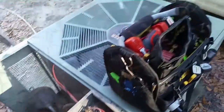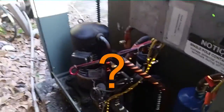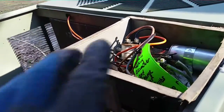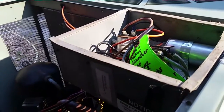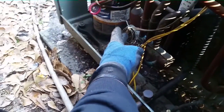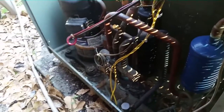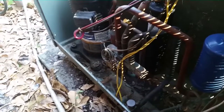I was watching the machine and all of a sudden it switched into cooling, right in the middle of the heating cycle - not a defrost cycle, just a regular old cooling cycle. I was going to check how many volts were coming in for the reversing valve, since it's energized in heating on this Rheem unit. Then I saw that the plug on top of the reversing valve was kind of tilted up - it had evidently vibrated loose.